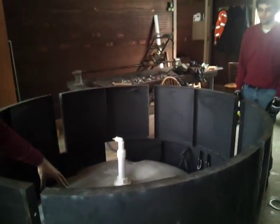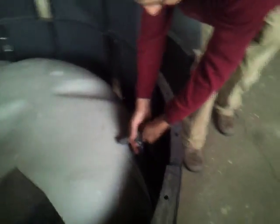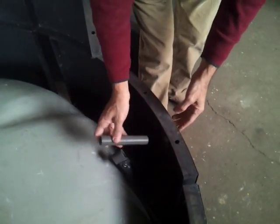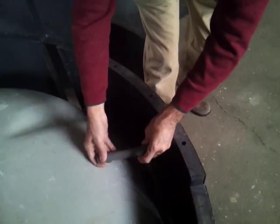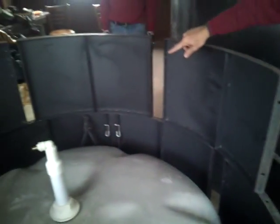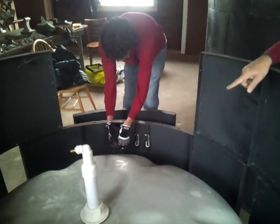The gas holder made of fiberglass is anchored — you can see how it's anchored — by removing the top set of molds. You see this pin here. This pin is long enough that it goes through the hole that would be left in the cement. When you actually make the mold, you pour the cement over this, and it leaves a hole, and this pin can fit through. That anchors the holder on three sides — one here, and there's another one down there.